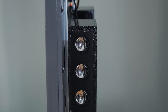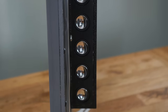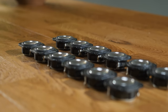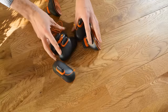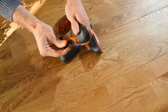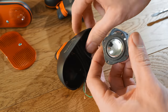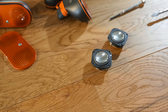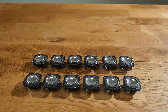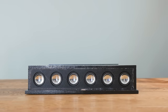As this speaker system needs to be very thin to fit onto the back of the mirror, we'll be using some small 1-inch speaker drivers. I salvaged mine from some speakers originally designed for old Sony Walkmans. As they use some weird proprietary connector, they're basically useless these days, which is why I decided to disassemble them to recover the speaker drivers. However, these small drivers can be bought individually from eBay, and you can find a link in the description.